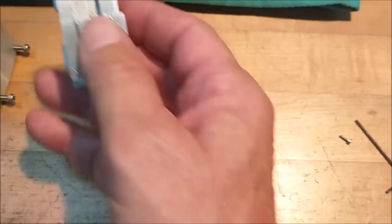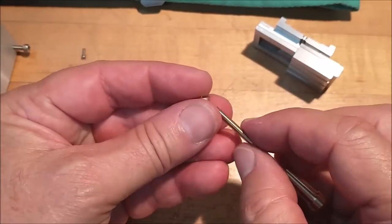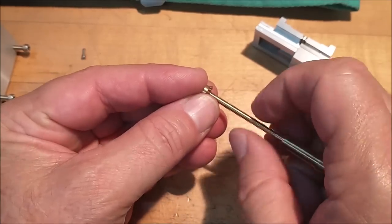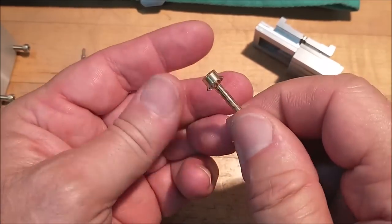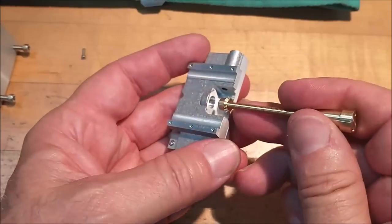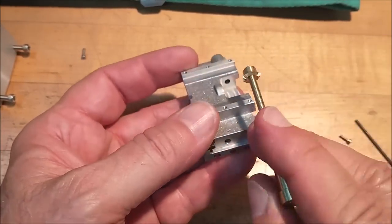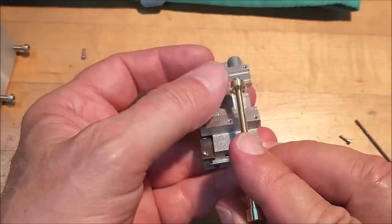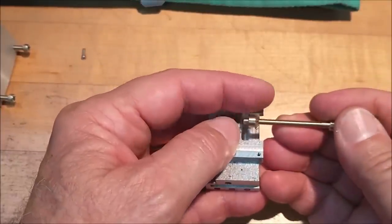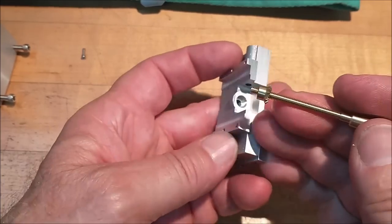Now ultimately, this little gear right here will sit inverted on the end of this screw, like so, and go up inside of this pocket right here at assembly. It'll be trapped, and the screw coming across will also have a bevel gear on it driving the other one. So as this one turns, this one will turn, and as this one turns, it'll consume the screw and the table will go up and down. So that's how that works.